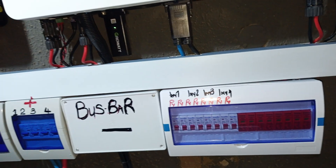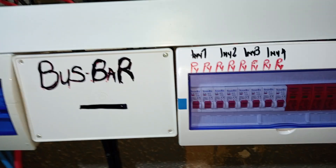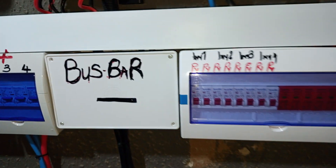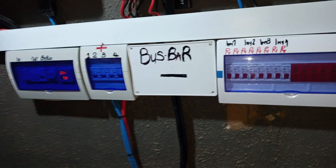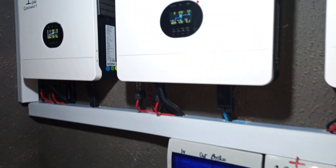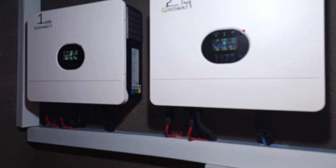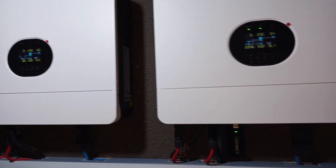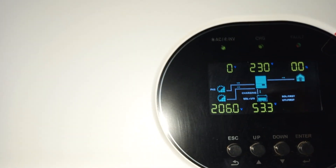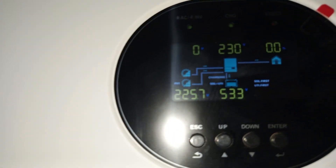How do you size your breaker? We also do proper sizing for our breakers — we take the ISC and multiply by the factor of 1.25 to get the breaker rating installed. As you see, we have 32 amps. If you look at the Jinko panels datasheet for the 580W panel, you will see the ISC there. From there you multiply by 1.25 and you know that 32 amps is the closest breaker to use. We also do the same calculations to get the AC breakers.